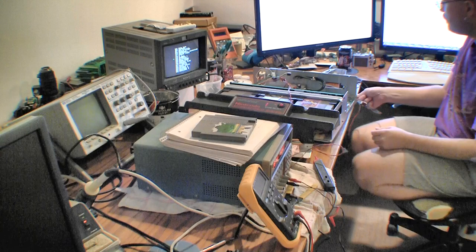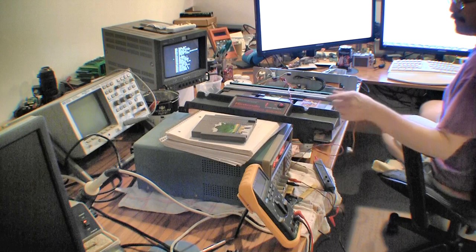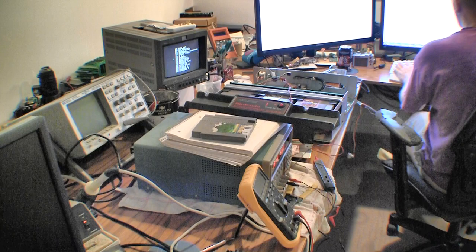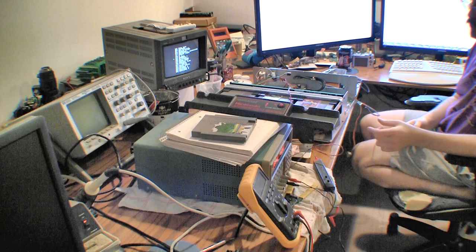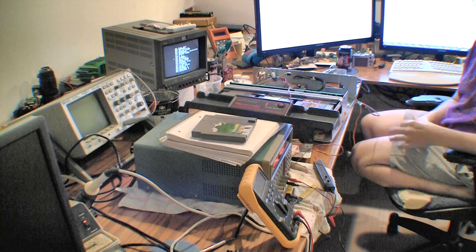Okay, so that's that. Now the last thing is we just got to detect the button held down. To do that, I will run a counter. When the counter expires, it'll make that display blank. And if it does it 3 times, it will reset the current game without changing the number. That's how it'll work.